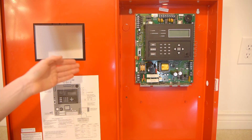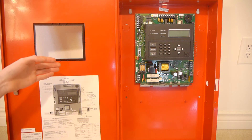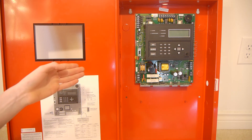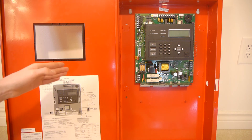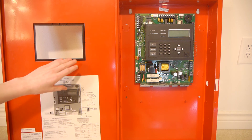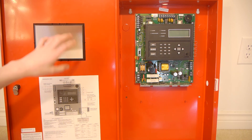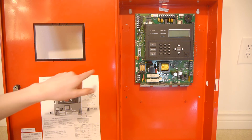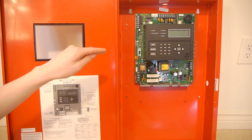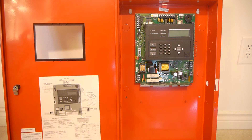If you're wondering whether to buy one of these panels — they're addressable, so I don't recommend them as a very first panel. But if you already have a couple of fire alarm panels and are looking to get an addressable one, they're pretty good. If you're looking for a panel that makes the lights blink really fast on the devices, this is not it — the lights blink once every 30 or 60 seconds on each device. The power supply is a little weird; I'm having some problems with it, not sure if it's because this one is old or a general issue, but it does get warm and sometimes doesn't turn on right away. I'll be making a programming tutorial and wiring tutorial for this panel soon. Thanks for watching.